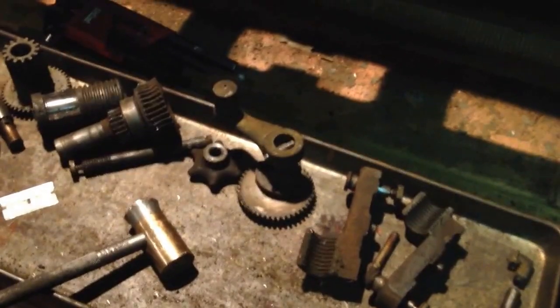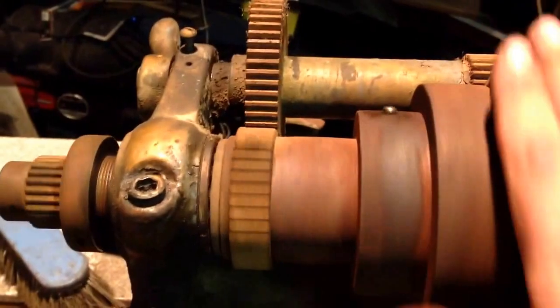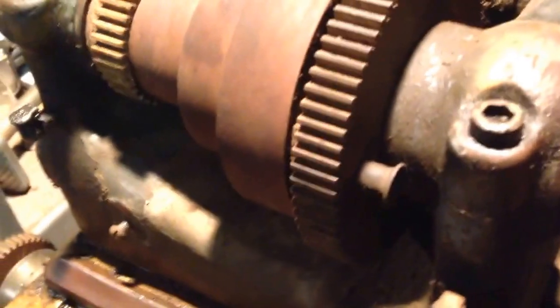Okay, thanks for watching. I was just working on the headstock a little bit more. You know, this turns very smoothly. I don't feel any grittiness or anything once I got a little oil in there. As you can see, I've loosened these. And upon closer inspection, it looks like we've got quite a good bit of shim left as well. Which is a good sign, especially with those caps completely loose. I can't feel one bit of play in this.